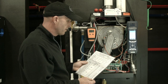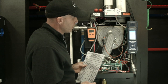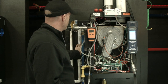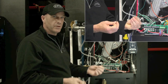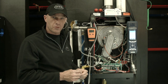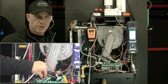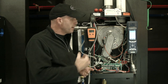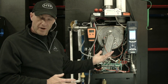I'm going to raise this up a little bit to get it to 8 to 9.5% on the CO2, just to give me a little room to move either way — it's a little on the lower side but within parameters. To make adjustments, you're going to need a 2.5mm Allen key and a 4mm Allen key. The 2.5mm is for the throttle adjustment and the 4mm for the offset if needed. You'll also need a flat screwdriver to access the manifold pressure. Since we're in high fire, we're going to use the throttle adjustment. On the throttle adjustment, it's an internal variable orifice — we go counterclockwise to open that orifice up, add a little more fuel. We recommend giving it small turns, maybe a quarter to half a turn at a time, and allow your analyzer to sample before continuing.